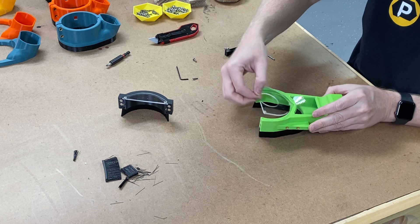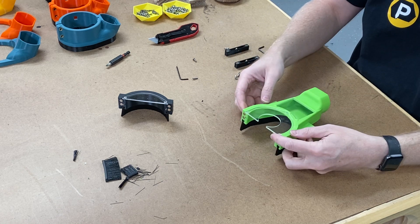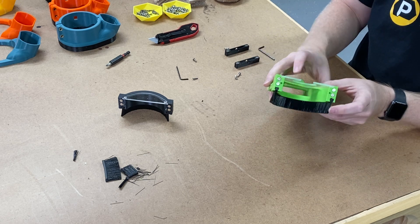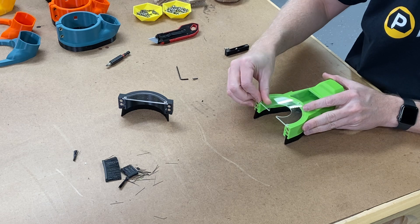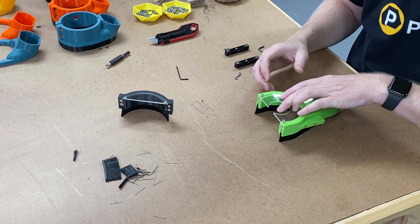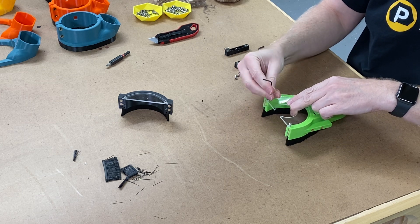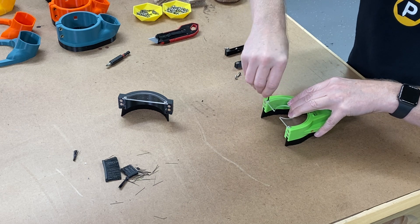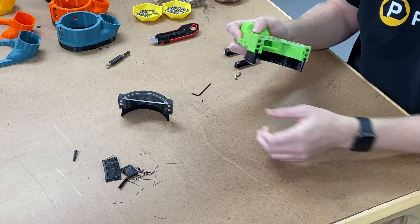Set the corner back piece into this little ridge here and then set it down. The idea with that ridge is it prevents the back from popping up during operation — mainly because I couldn't find a good third piece that still left the large opening for the intake. Now that the plastic is on there, we're going to put our two button head screws on, the same way we did with the face piece. Hold it back so it's flush and send the screw down so the head is flush, then switch to the shorter side — just a half or quarter turn to get it nice and tight. That acrylic piece isn't going anywhere.